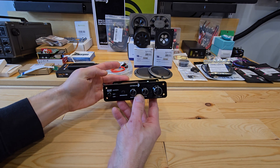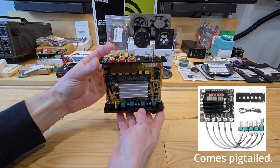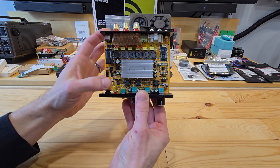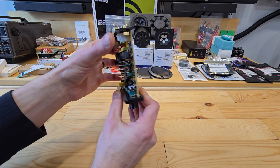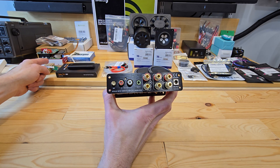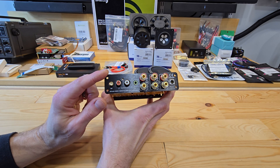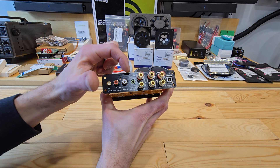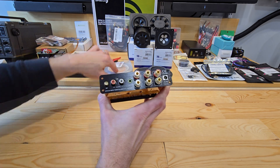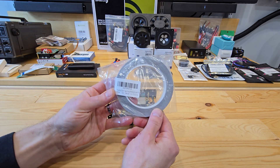For reasons specified in my last video, I chose this 2.1 channel amp made by Dayton Audio. There are easier amps to retrofit like the Django I've previously demonstrated, but I think extending the front panel potentiometers will be worth it, and the LED status board is already broken out. I'll be using its RCA inputs for my Pi's DAC connected with 12-gauge RCA cables, and if Bluetooth is not enough for a secondary input, I will also have an AUX input extended to the TV's exterior. This cable, as well as my potentiometer extensions, will use cloth EMI shielding to minimize unwanted noise.